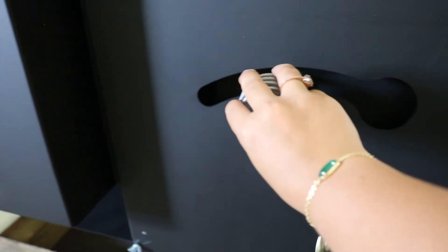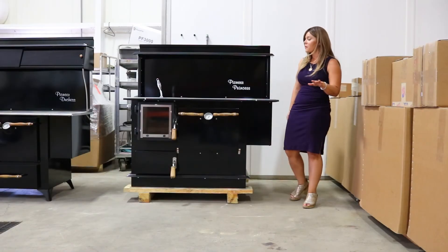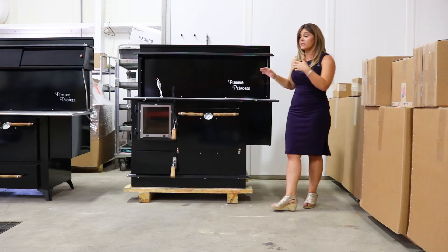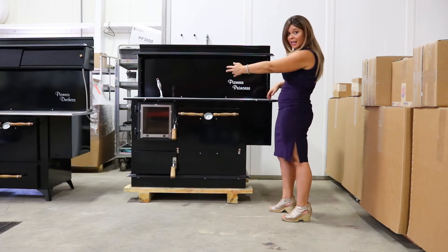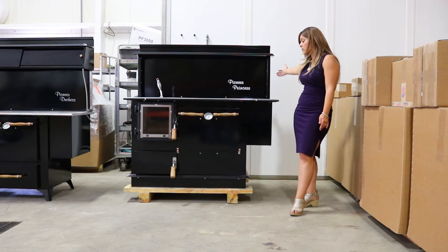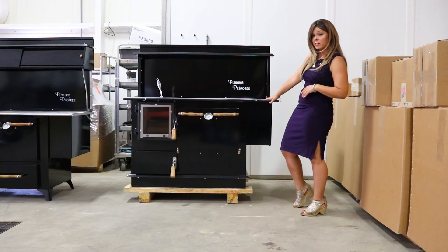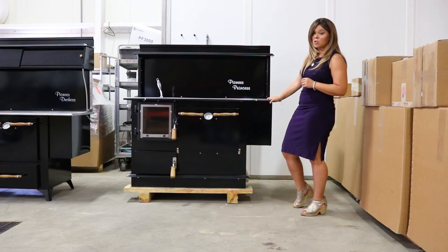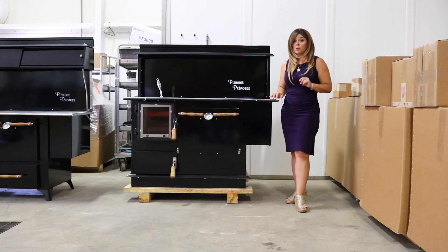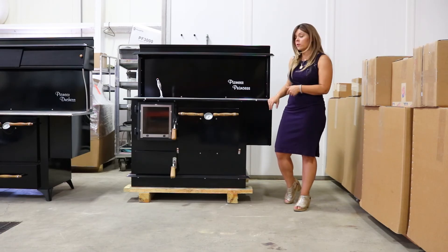This is your simple shaker handle for inside the grate. Let me give you guys some clearances as well. This model is UL listed, so you're good to go there. Clearances when facing the front of the stove from the left-hand side are going to be 25 inches. You're going to have a 25-inch clearance off the rear of the stove. The clearance from the right-hand side when facing the front — which is going to be your oven side — is going to be 18 inches off the wall.